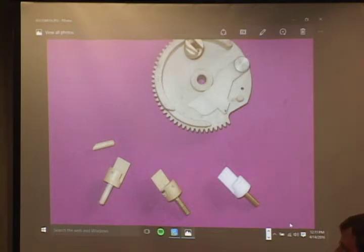I think it only ever breaks because it just becomes weak and brittle. It causes the motor to stall eventually, because it's trying to make the mechanism work. All that force is in one spot. That one little piece raises and lowers the arm, the bar that raises and lowers the disc, the transfer rod, and it also hits two switches. It spins over, hits one switch, and then it knows to do certain things, and when it's unloaded, it hits the other switch and knows when to stop. So maybe the worst would be a switch or two.